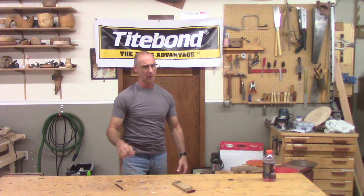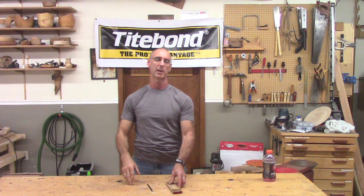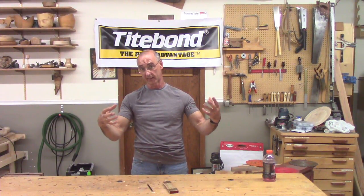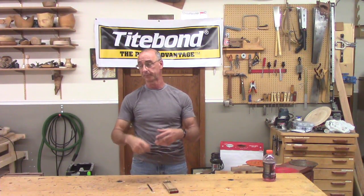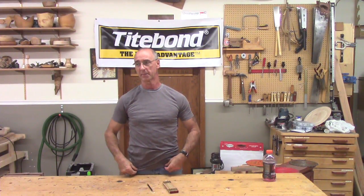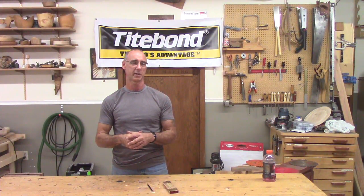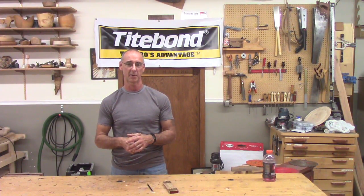So I think you're okay on the moisture content, but I think just because as you hollowed, you relieved pressure, it reacted. And if it dried to 6% as a log, there was probably all sorts of internal pressure in there, because wood just doesn't dry well as a log. So that's my guess, is that that pressure got the better of it, and that's what caused the crack.